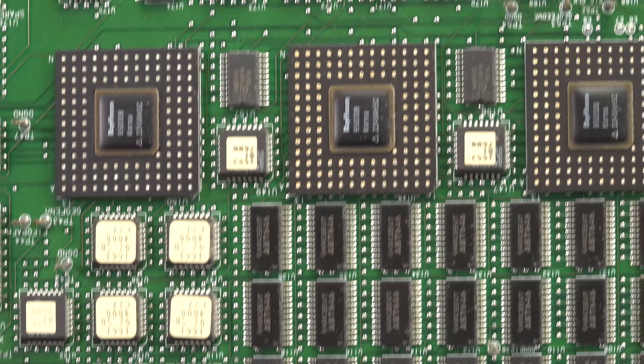This bad boy is the sample space processor — it does FFTs, Doppler color imaging, and sampling — all the really grunty stuff in the actual display. Look at all the Analog Devices DSPs. Have you seen that many DSPs on a board before? That's insane. We've got our first ATL branded chips — some custom ASICs. Not sure who AMI or AMIS is — if you know, leave it in the comments. Basically it's doing a lot of grunty DSP, FFT, and sample space processing. 10 layers again.